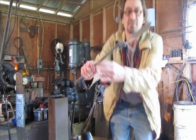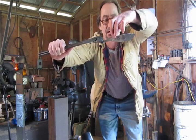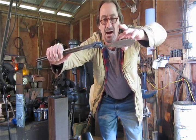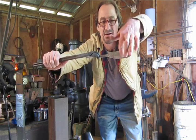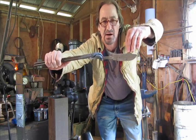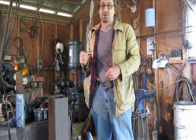Today I'm going to clay this knife — and even though it's Damascus, I'm going to see if I can get a hamon or tempered line to show on it. What I'm looking for is to heat up just the edge area to orange, and the back will be a darker red. Then I'll quench it very quickly and put it into this preheated oil, and that will harden the blade.